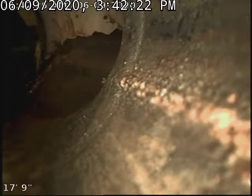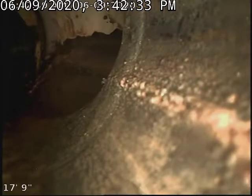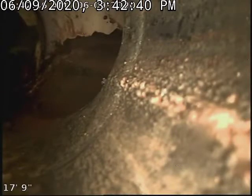I would do this Y — get rid of this Y here. Cut on both sides and do our strong-back connections; you'd be very happy. Embed it with crushed stone, Schedule 40. This line will be tight. Then jet out the rest of it and push all that debris out into the main, and find where that actual ending point is — I'm very interested in that. But if I can get you operating, that's what we're going to do.